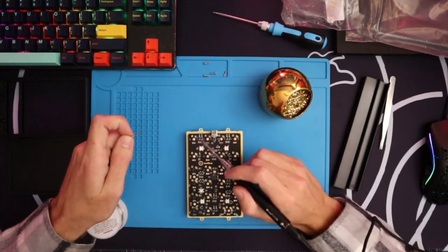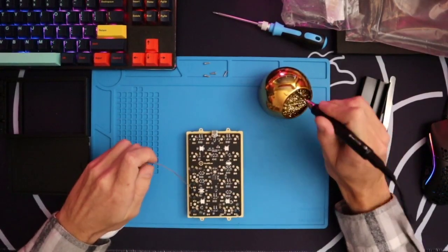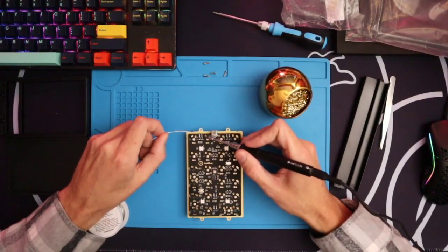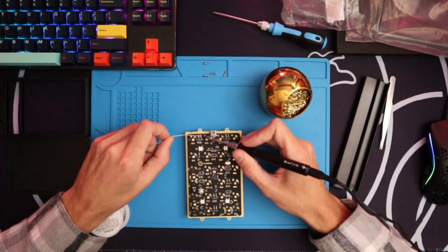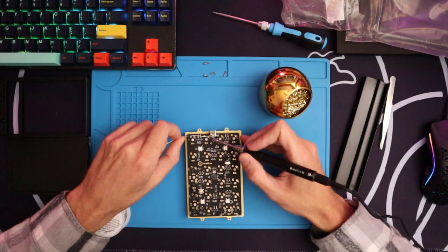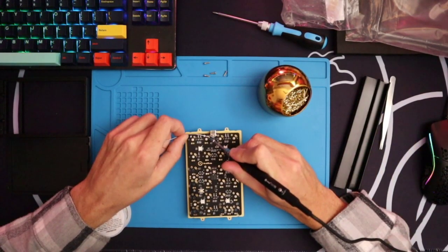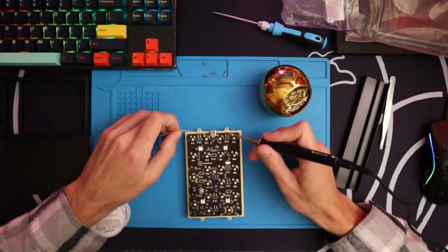That's better. What just happened is I had a nice, perfect cone form. And when you do that, then you start getting into the rhythm of it, and you basically have to push solder through. And I'm trying to make sure that I don't have too much bleed over onto the side where the metal contact is. That's a nice one right there. Another one right here. See, that was a bad one. So what I'm going to do is clean off my tip. That's good. That's a very nice connection. Very nice solder.